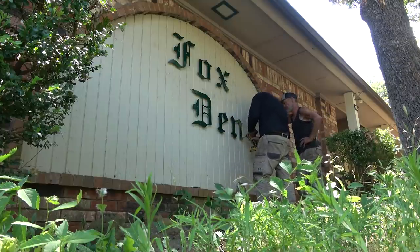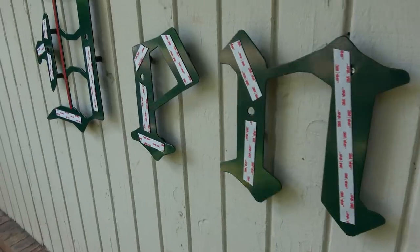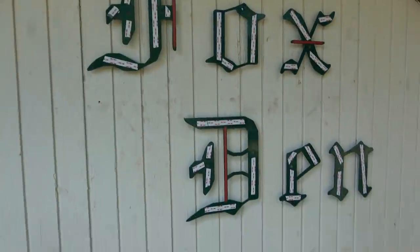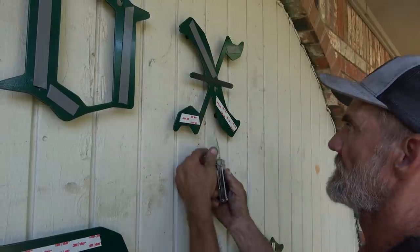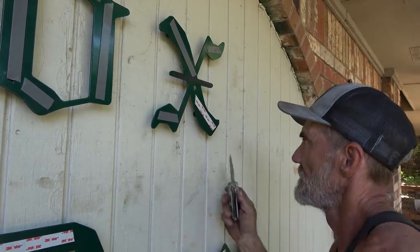After getting all the backer pieces secured, we're going to run around and stick VHB tape everywhere. We're using a lot more tape than we need. I like to go a little overkill. The stuff isn't that expensive. Got a link down in the description for it. It's great to use. I've got it in a bunch of different thicknesses, and you see here there's a couple different colors, and that's just one of the widths. The inch wide tape is gray and the half inch wide tape is black for whatever reason.